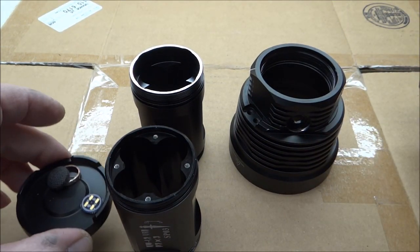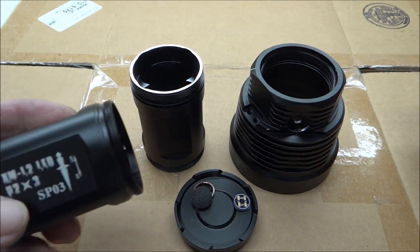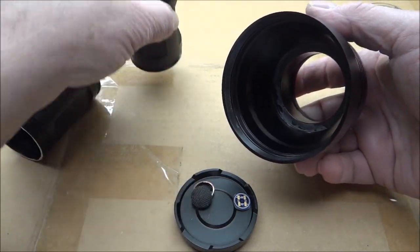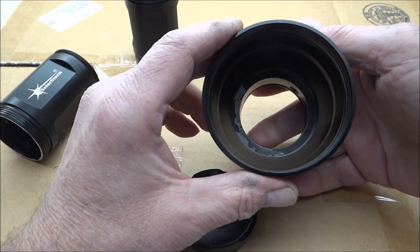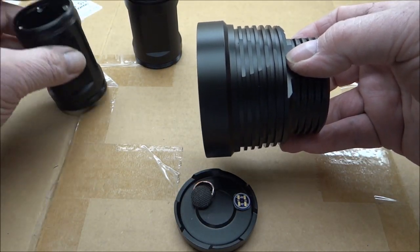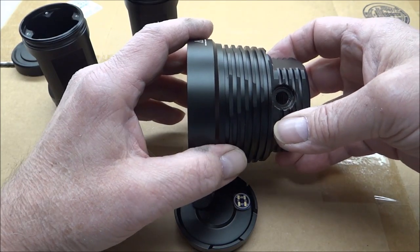The first one is the Solar Storm SPO3. It's a three-LED light with fairly large reflectors and a good-sized head. I've done this before — it uses 4x18650, but I'm going to be using 8x18650 in a 2S4P configuration.